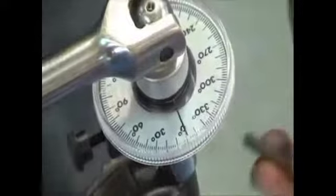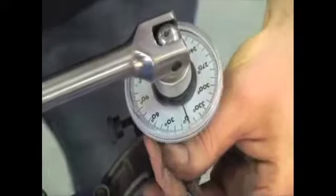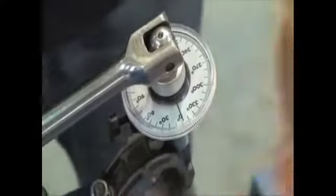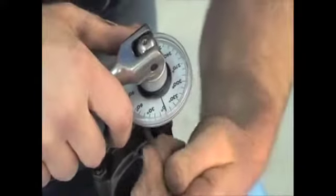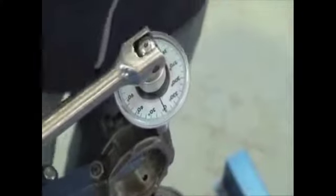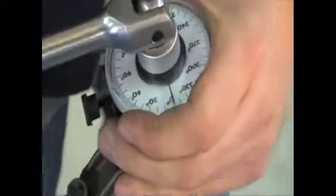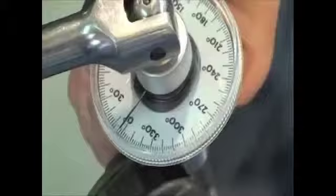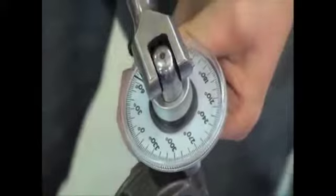So is there torque wrenches in the marketplace for that difference? It's called torque to yield. Falcon were using it a long time for their cylinder heads. And what it'll say maybe the first step is tighten it up to 60 foot pound or whatever it may be, the desired setting, then tighten a further 180 degrees. So what this is, just a degree wheel, set it up so the base itself doesn't turn, you're just using this. And then as you do this up, you can see your degrees in place and you just turn it. And it's 60 degrees.